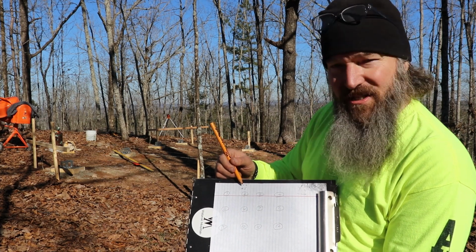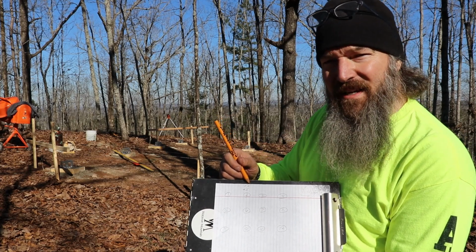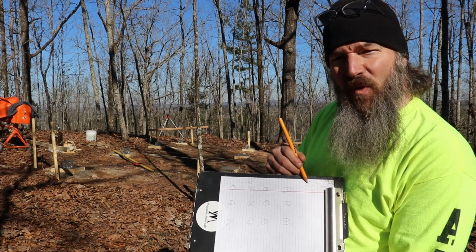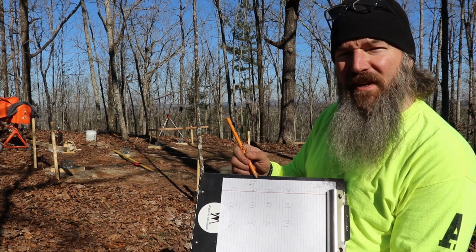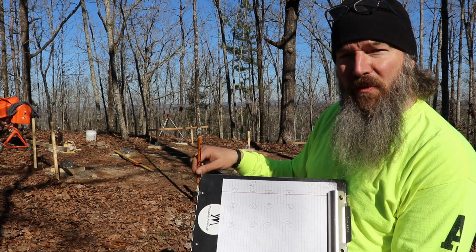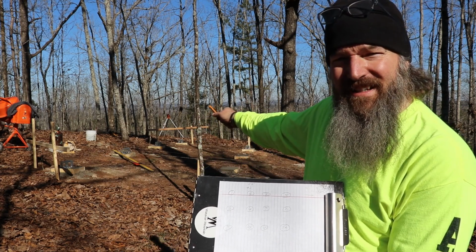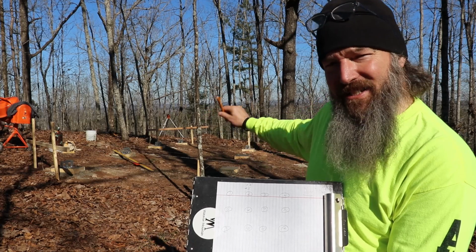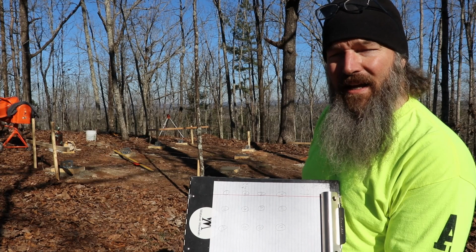plus 3 inches, because when I measured that post, it was 2 feet 2 inches. So our starting is 1 foot 11 inches, right? The next one was 2 feet 2 inches, so I need to go up 3 inches. So I'm gonna cut that second post at 39 inches. You tracking?